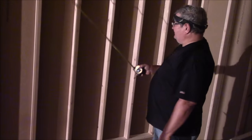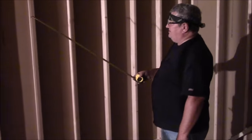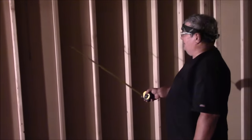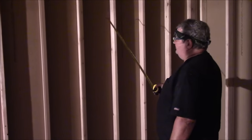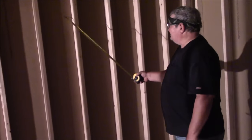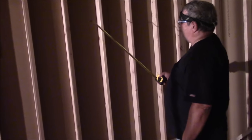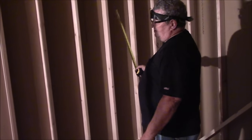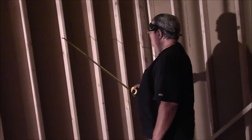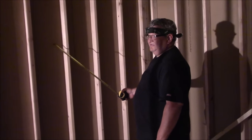And I explained to Gail, because of where I put our bedroom wall, if I use two existing studs, it's going to be 5 inches off center. If I wanted to put the window exactly dead center of this room, I would have to add a stud here, add a stud here, cut these two studs out, and work from that. And I think this, being a bedroom, you won't be able to tell it from the outside. I think we can live with being 5 inches off center to make life a little bit easier for installing this window.